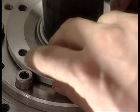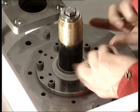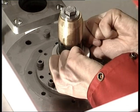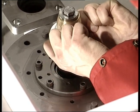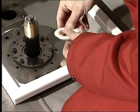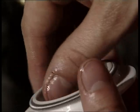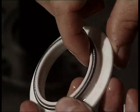The Framo single cargo seal must also be dismantled. Changing of cargo seals is a normal service job on typical wear-and-tear parts, normally done by the crew on board. We recommend changing both the single and double cargo seal together — they are now delivered as one spare part.